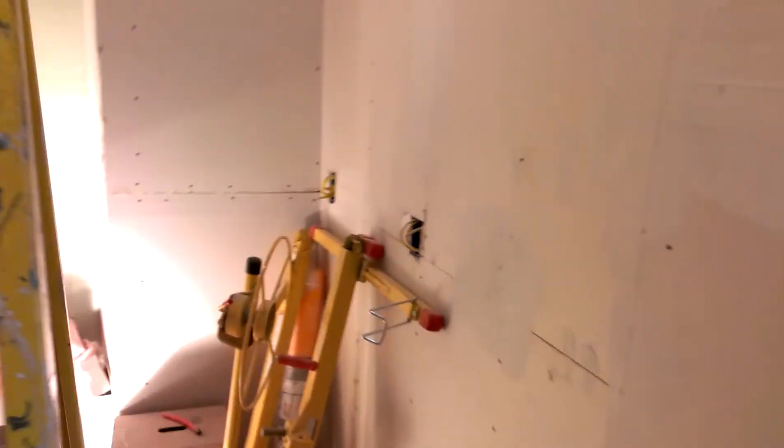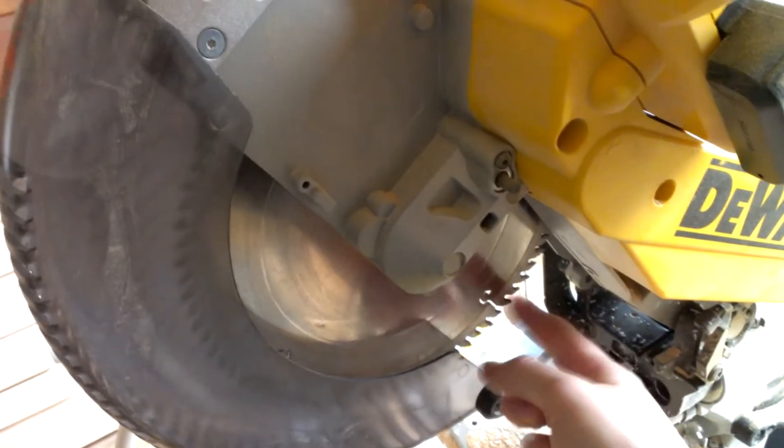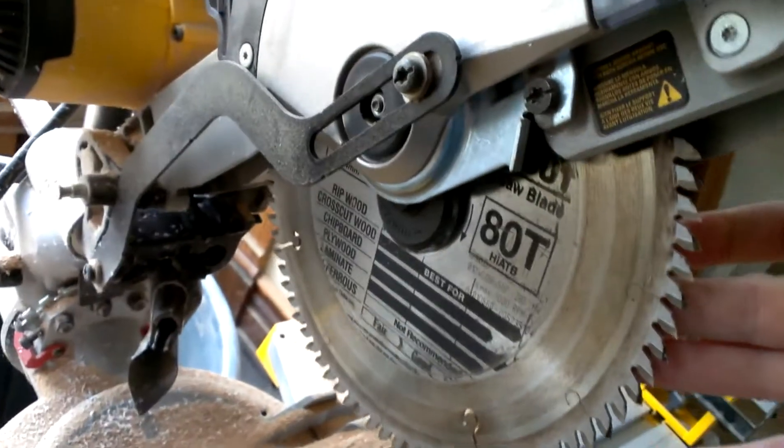I'm making progress here in the Oak Street house. I guess I can walk in here and show you the kitchen. We got the floors down in here once again. Loving the Makita compressor here and the cleat nailer. I will say one thing — man, that hickory floor eats blades. This is a high-tooth Freud blade that I just had for an old miter saw, and man, it pretty much burned it up just cutting the wood in the kitchen and the floor.